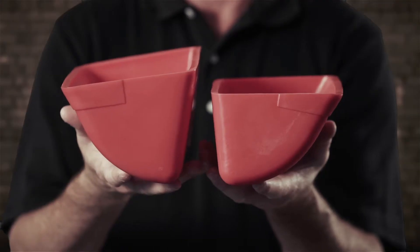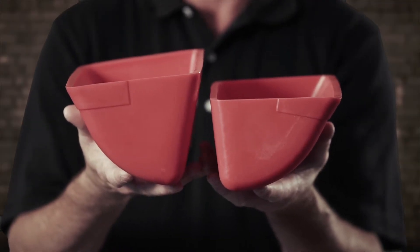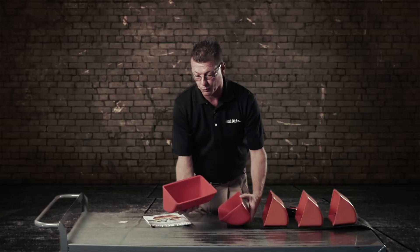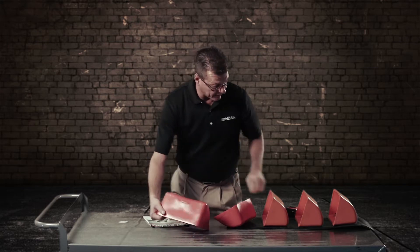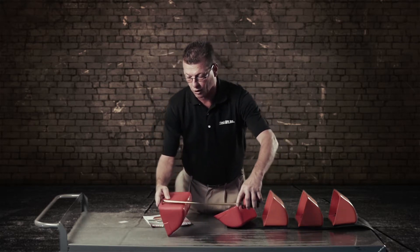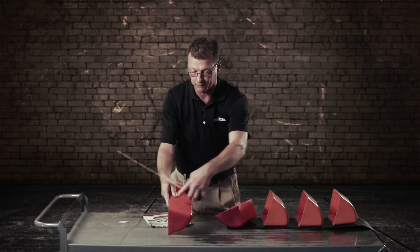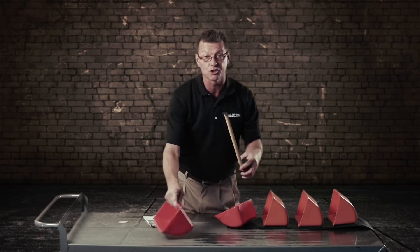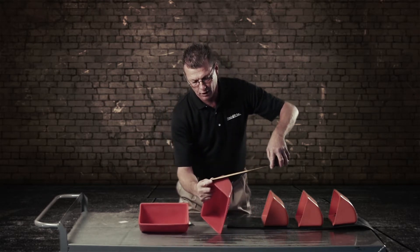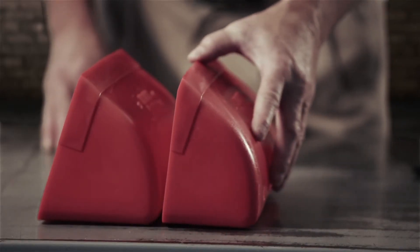You can tell the difference — they're flat, and this one has a taper. You've got about a 15-degree angle on this. If you don't know what you have, all you have to do is measure. We measured on the back side of a standard one. If you don't know if you have a low profile, right here you've got five inches on the back side from back to the bottom — that's your standard bucket. On a low profile, you have four inches. So you can really stack these buckets really tight.